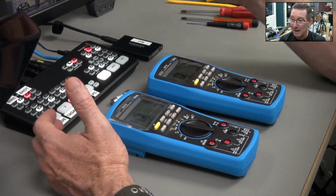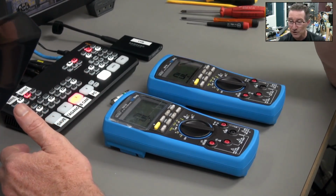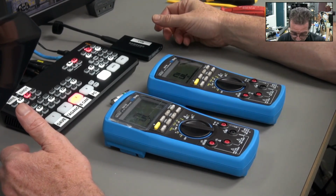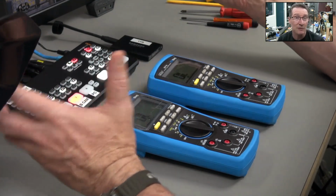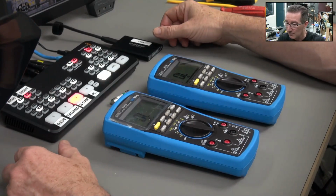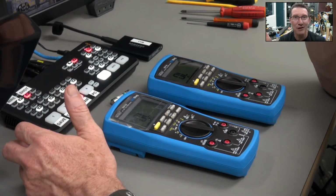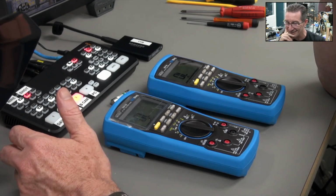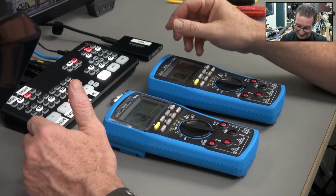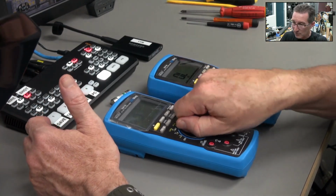And then get one of these, try and find a faulty one, and then extensively measure and compare those ones with your tolerances for your switches. They'd have a drawing, for example, that specifies tolerances for all the plastics and the molds and the contacts and everything else. And yeah, only Brymen would have that sort of data. So in theory, I could do the thorough investigation myself, but it's many, many days of work, I think, to really get to the bottom of something like this. And you may not. It may require Brymen to do it.